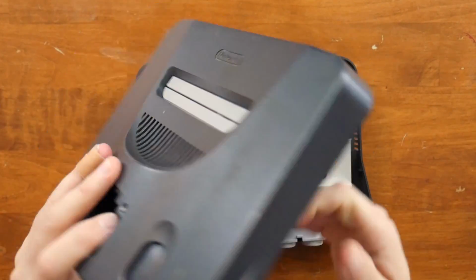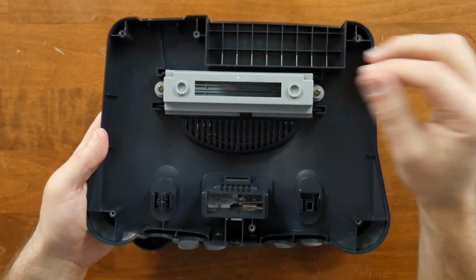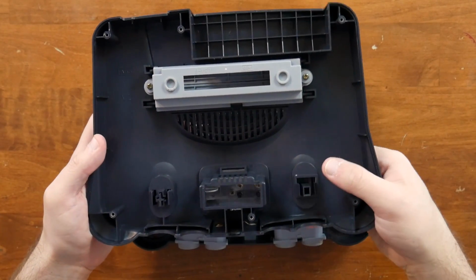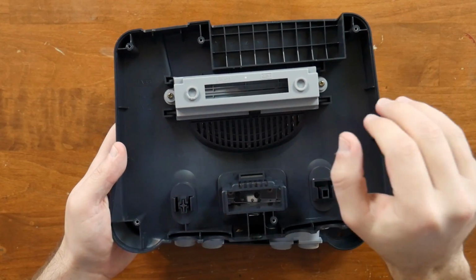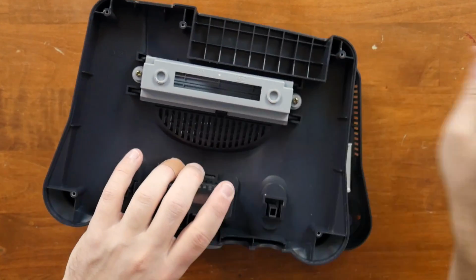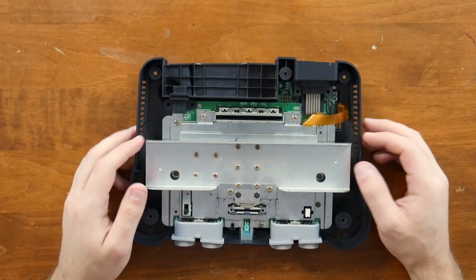That all comes apart through the back here. This actually comes right off with the screws, and you can take that off. You can pop these right out. So if yours get kind of sticky over time or they don't move as well as they used to, if you pop these all out, there's some metal springs in here, you pull those out, you can actually just drop this into soapy water for an hour or two, and then everything just wipes completely off and it looks almost brand new for those parts, and they feel brand new with the power and the reset.